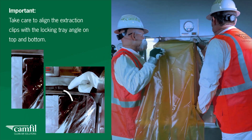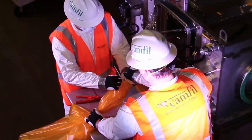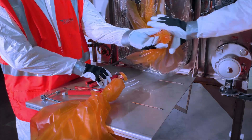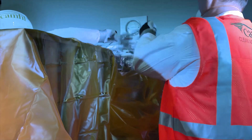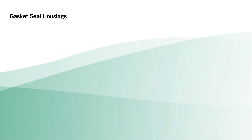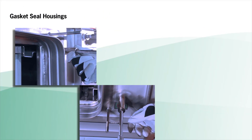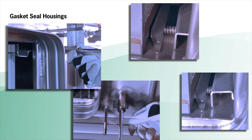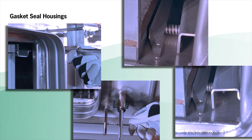Carefully slide the new filter in the change-out bag into the housing. If additional filters need to be installed, gather and strap the change-out bag as before and cut the bag away, leaving a stub bag on the bagging ring and a larger empty cut bag to be disposed. Prepare the next filter and new change-out bag and repeat these steps until all filters are installed. For gasket seal housings, using your ratchet wrench, turn the drive bolts clockwise — top and bottom alternately. Tighten the upper clamping mechanism until resistance is felt, then tighten the bottom mechanism until it reaches its mechanical stop. Finally, turn the upper clamping mechanism closed until it reaches its mechanical stop.